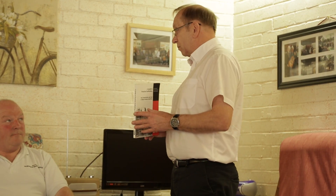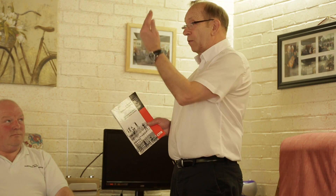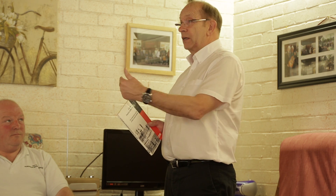When you erect a scaffold structure, you must not have it further away from the building than 300mm, and that's to stop you from falling down through it. The inside upright pole — the standard — is against the building. If you want to work really close to the building, you could have an inside board with effectively no gap at all. But for painting, cladding, and repairs, it's handy to have that 300mm gap between the scaffold structure and the face of the building.